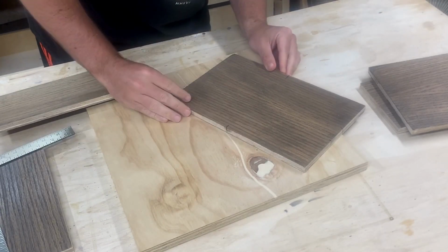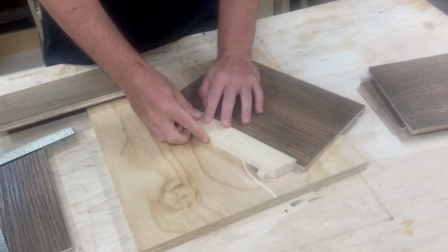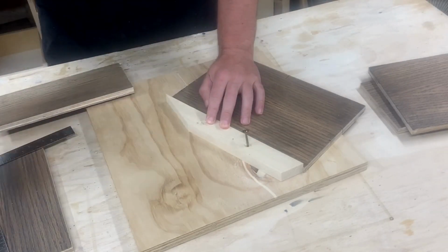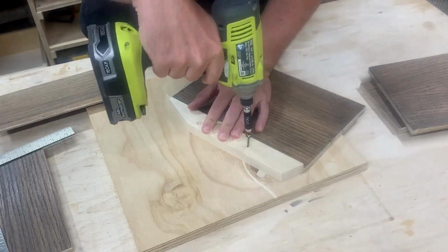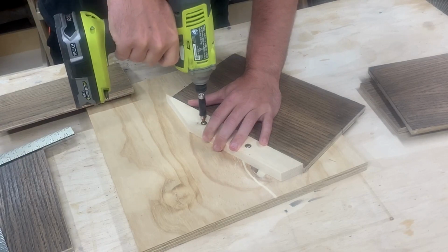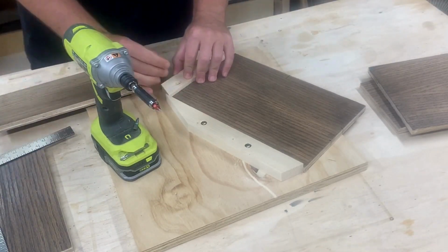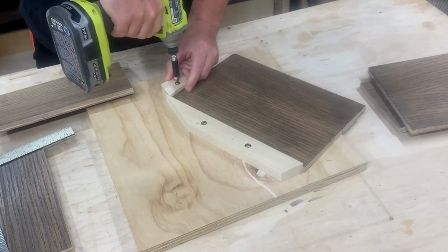you'll be cutting. The edges of your base need to be parallel, and make sure you pay attention to which side your fence will be on and which side the saw blade will be on. Screw down your 2 pieces of scrap wood on the perpendicular sides that aren't being cut. You also want to make sure these pieces won't hang over the side and hit your table saw fence.